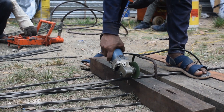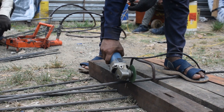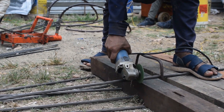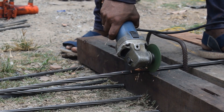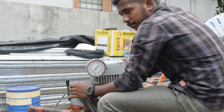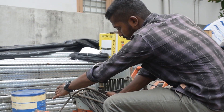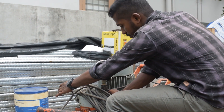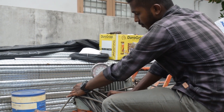Hi everyone, welcome to this video. Fixed anchors, also known as dead end anchors, are an important part of post-tension structures. They provide a strong bond between the pre-stressing steel and surrounding concrete, and reduce the length of transmission of pre-stressing force from the tendon to the structure.